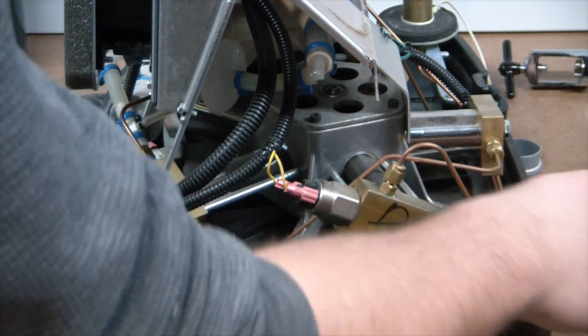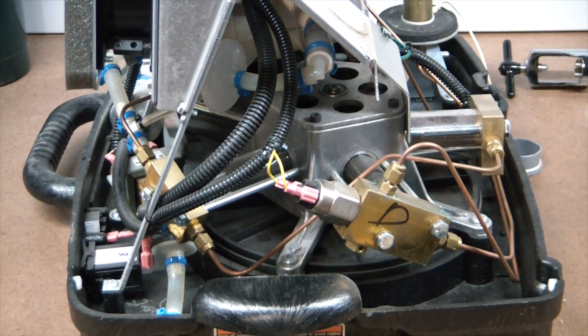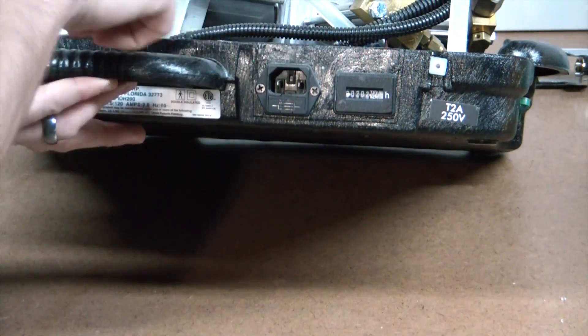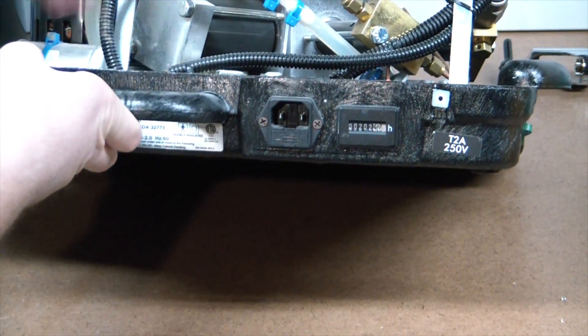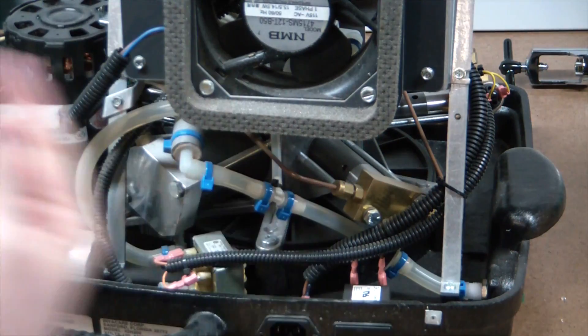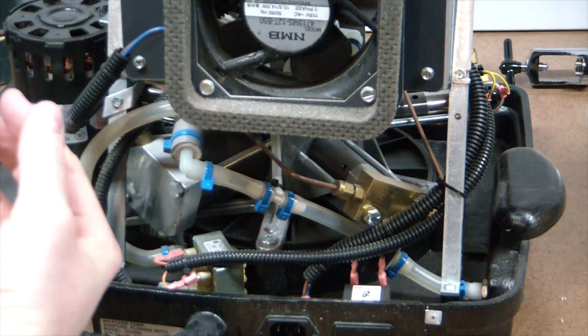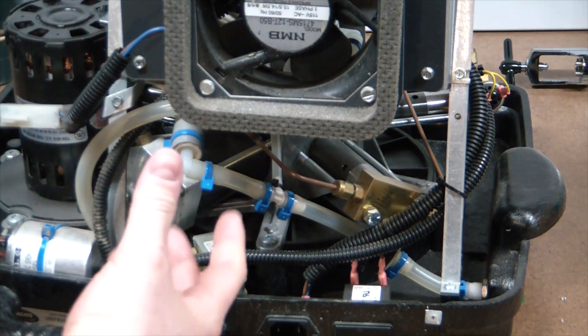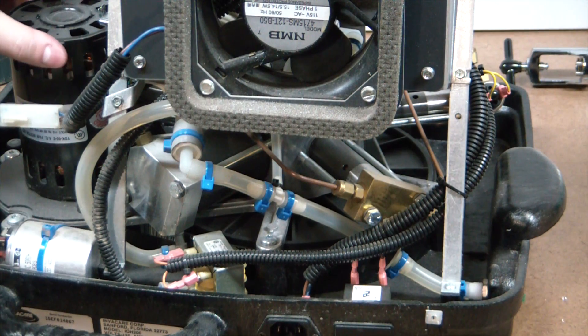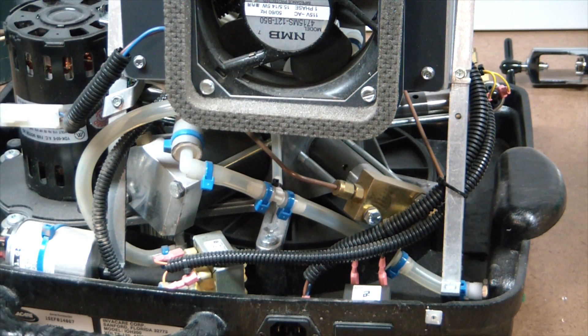As I mentioned, this fills an oxygen bottle to 2,000 psi — and for something so compact, it's mind-blowing. It's not the fastest compressor in the world, but you can see how they did it: they set up multiple stages, a total of five stages with varying cylinder diameters. The motor goes over a big pulley connected to a crank, which turns a piston in each cylinder. Given the different diameters and pressures, the load is pretty well equalized, so the pump is doing minimal work and not having to fight the massive pressure of 2,000 psi all at once.